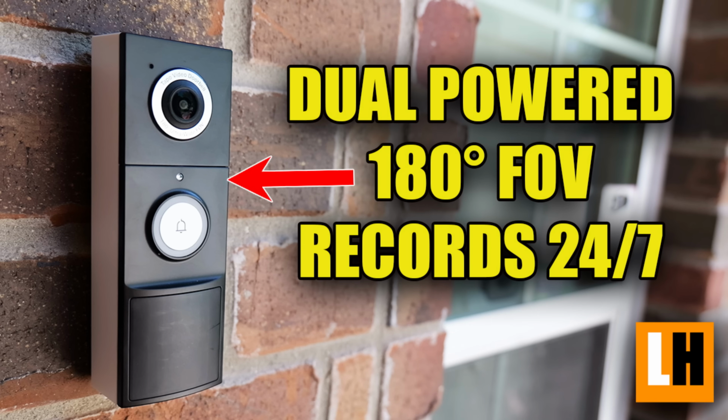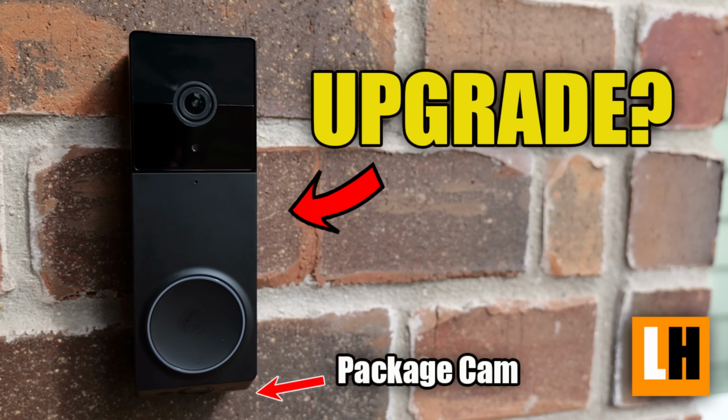I've been seeing a lot more of these types of video doorbells that are dual-powered, and this is a good thing. It started with the Tapo, and also just in my last video, the Wyze Dual Cam Doorbell. They are designed to be battery-powered, but when wired into your doorbell wiring, they can charge the battery but also can be set to record 24/7. And one advantage of this battery and wired option is that when power is out, if you wire this in, the doorbell will automatically switch to battery mode.